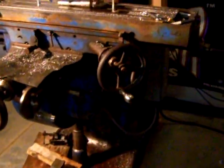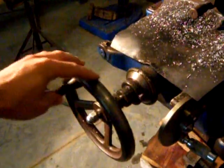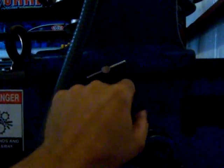I bought this machine at a scrap yard. They actually dropped it and I had to straighten the shaft back out. They picked it up with a claw and broke off the part that holds the motor tight when you change the speed. They messed up that tag right there and had crushed all the conduit, so I replaced all the conduit. The motor originally had the wires on the other side running through there and into a different box — I changed that. I turned the motor around so I have the wires running straight down instead of going through all that center casting.